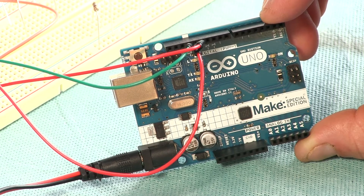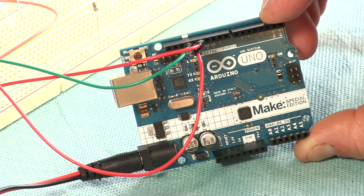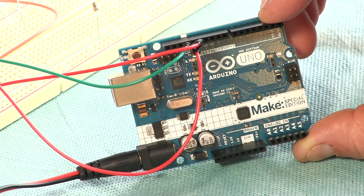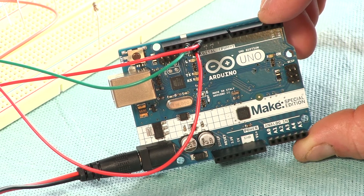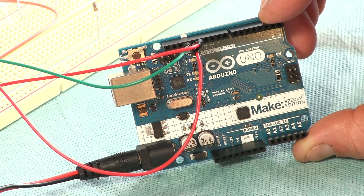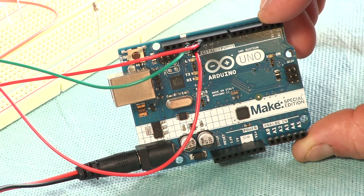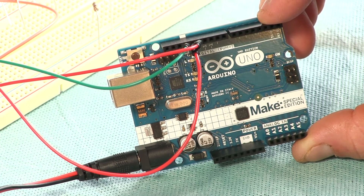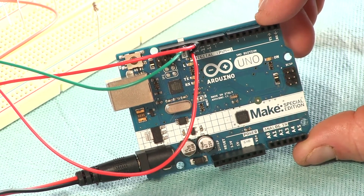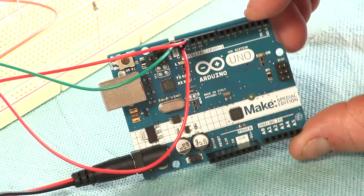What I did is I put my navigation lights on one circuit and my collision lights on a second circuit. Everything that's constant will be running directly off of 12 volts because I have everything protected with resistors. These boards — I know the ones I'm going to use can run off 12 volts, and I like to run all my systems off 12 volts using a transformer you plug in the wall. Anyway, enough talking about this — let me show you the results I've gotten.